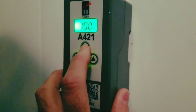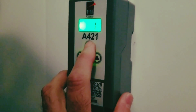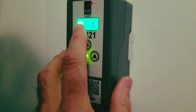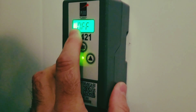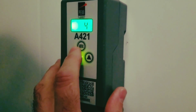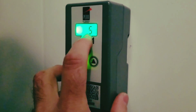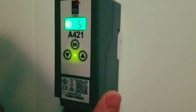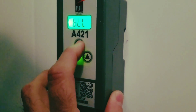This is the anti short cycle delay — currently set for one minute. We're going to see how the machine runs with it at one minute and change it if needed. This is the off setting — currently set to turn off at four degrees Celsius. And this is the on setting — currently set to turn the condensing unit on at five degrees Celsius. We're going to be playing around with these settings until we get it running the way we want, and there's more in there that we're not going to get into.